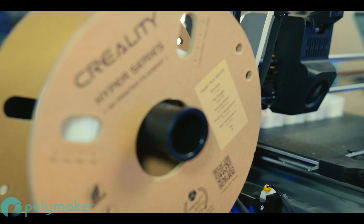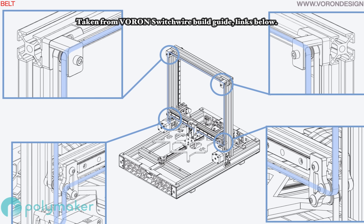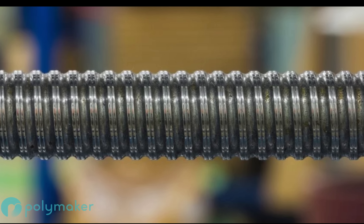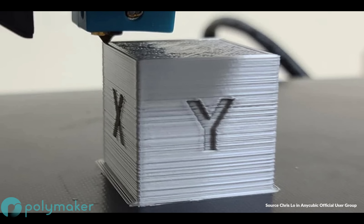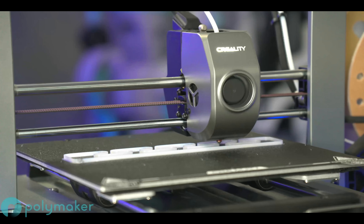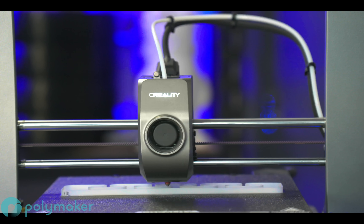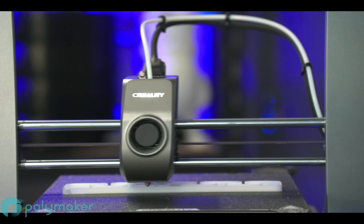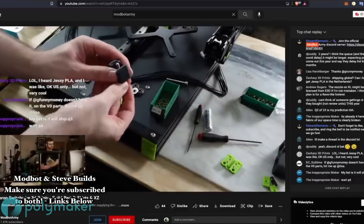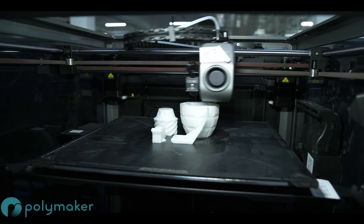I want to talk about Core XZ kinematics and look at whether this has been done before. Core XZ enables rapid movement along both the X and Z axes, eliminating problems associated with lead screws — even a slight bend or desynchronization can result in undesirable artifacts on prints. The Z-hop speed is increased, though time saved is most likely negligible. Searching online, the only other Core XZ printer at a production level appears to be the Switchwire from Voron. Modbot and Steve Builds have undertaken these builds with very positive feedback, but Core XY printers are still preferred as Z-speed is less important.